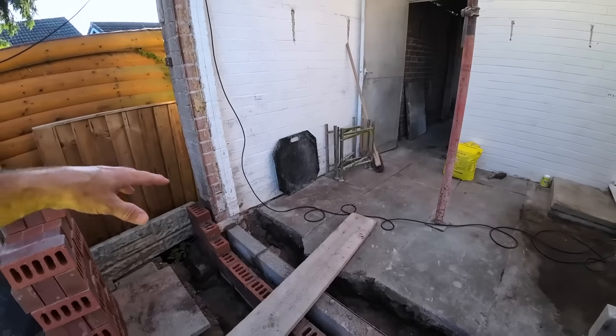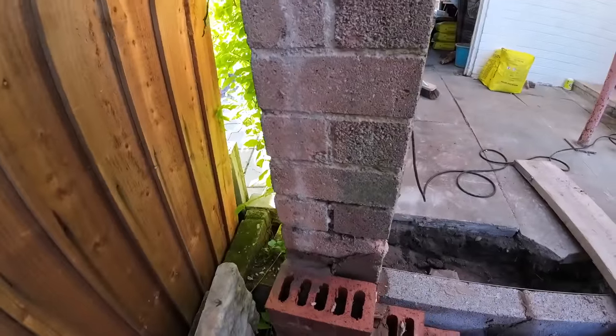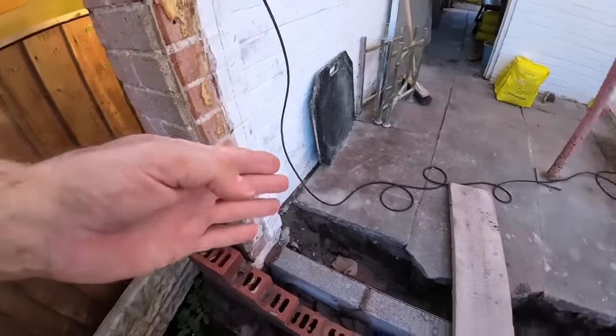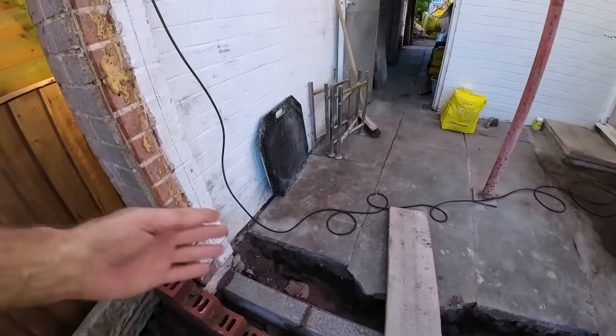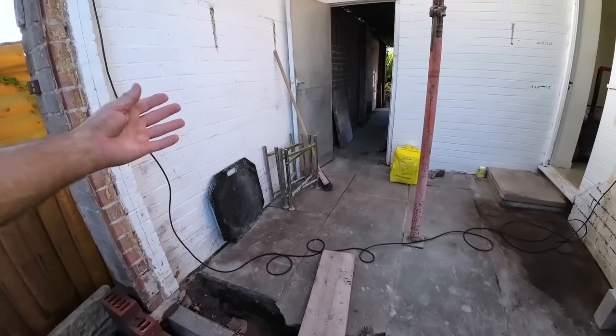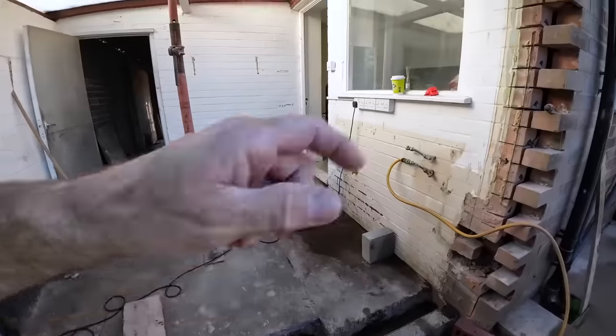So we've got to make sure these pillars are decent sizes, because as you can see, that's all that's tying that into there. Obviously put screw ties in every three. But then you have a small pillar, then a door. So just to give it a bit of strength, run a decent sized pillar between the door and the window, because obviously you've got the door swinging on it. A little tiny window and then brickwork here.